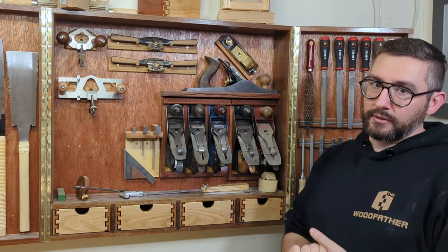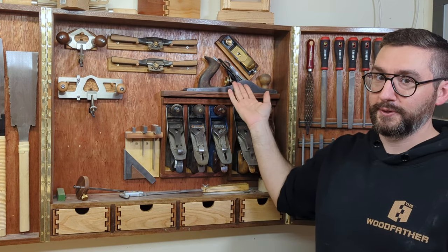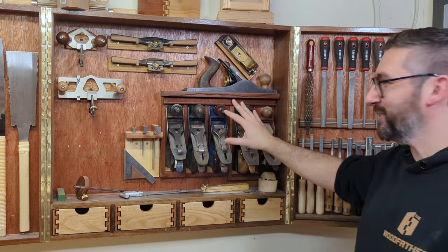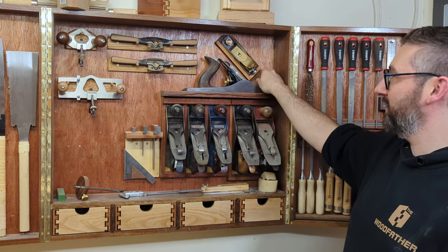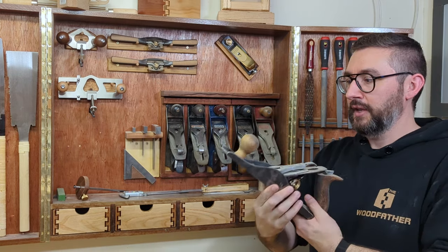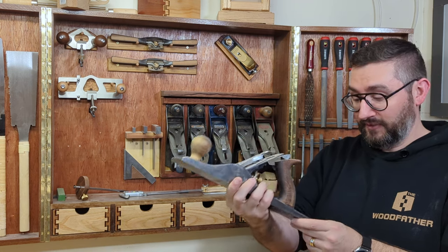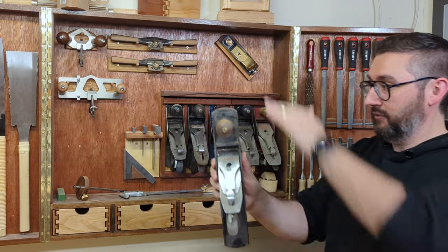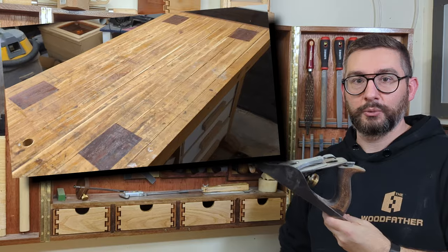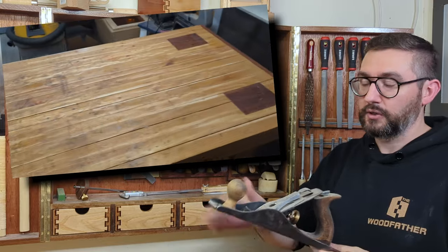When I was a little kid thinking of what a woodworker was, I thought: someone who has a plane and knows how to use it. I still think that. This is woodworking for me — seeing a hand plane, that's what I think of. This number five — I would have said seven because it seems so big. I bought it specifically to flatten my workbench, which I did a couple of years ago. Originally I'd flattened it using the router sled method, but after eight years of gouging it up I wanted to do it by hand, so I bought this and tuned it up.